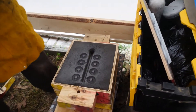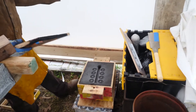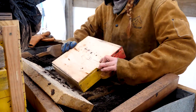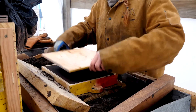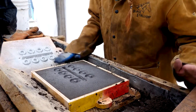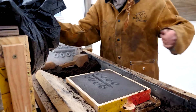It pops up on the top, then goes down — it'll fill this one, then go down to the next one and fill the next one. That way we can maximize the amount we can get per pour. Careful not to flip it over or disrupt too much — I did kind of bump the pattern board, but hopefully not too much. Nope, it's pretty good. Nice thing about a pattern board is they're all going to be the same.